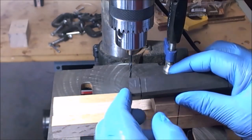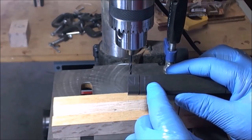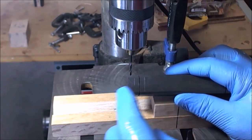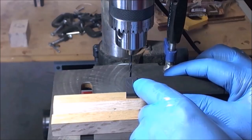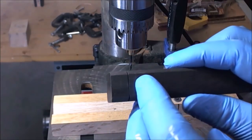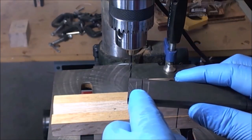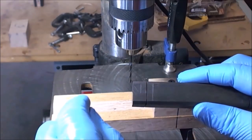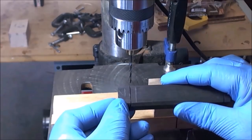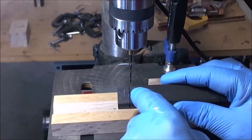And then on the other side, I'm going to drill the same holes. This will be for the cap, for the Celtic knot that we made earlier. I've got a little quarter inch mark right here in lead. I don't know if you can see that or not. There it is. I'm going to turn that down to a tenon, and that's going to go into the cap on the other end with some veneers. And I'm going to drill my holes for the plugs here.